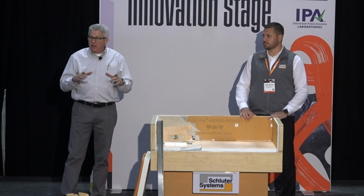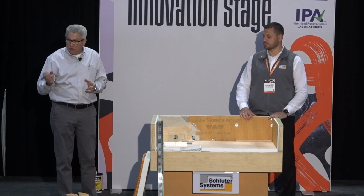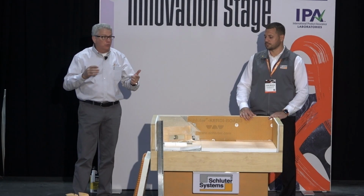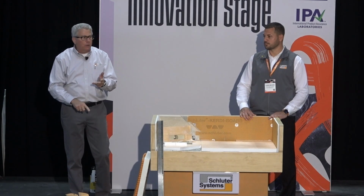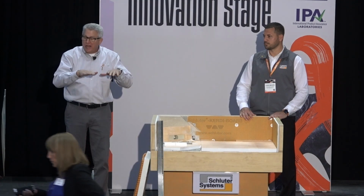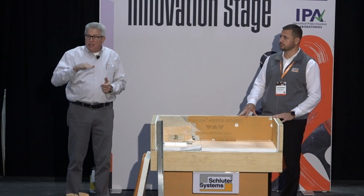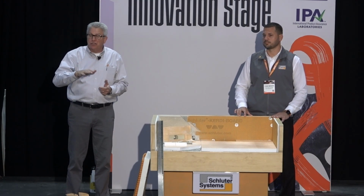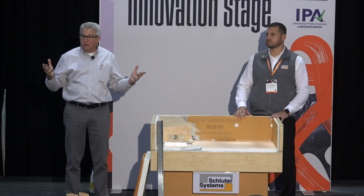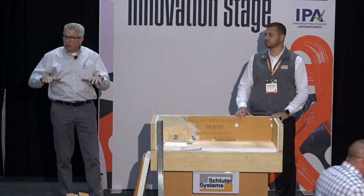The integrated bonding flange is what it's actually called in the Tile Council of North America handbook. That's more of a generic term. What that allowed us to do was take any of the surface waterproofings, whether sheet applied, trowel applied, or liquid applied, and now they had a bonding flange. They also had their own drain housing that would accommodate the surface waterproofing. So it was really the missing link, the part that completed the system. Once that was on the market, it allowed all the tile installers to start doing a full, comprehensive approach to surface waterproofing.